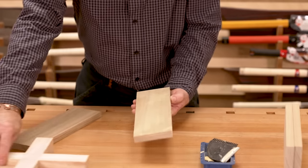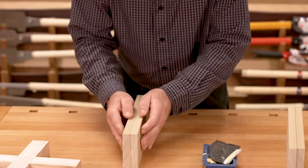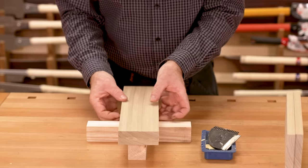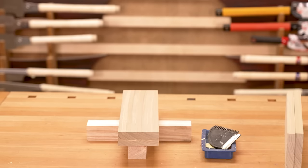Just going to bring our boards back together. Going to fold them up. Get rid of the air in between. Going to do a small rub joint. Trying to level up the ends now. They're not cut to the overall length at the moment, so just trying to level up the ends to make it easier.